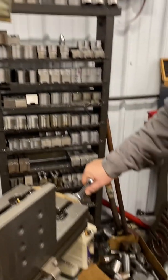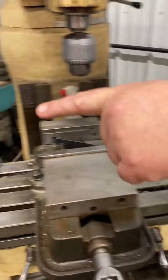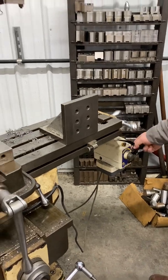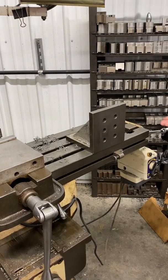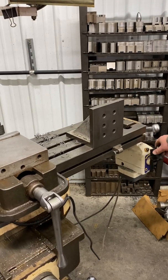This right here is my handle for my X. As you can see, the X table will move. I have a handle over there as well connected — you can go from either end. I also have one that has a motor on it; I can slow it down to feed it real slow if I have an end mill that wants to cut real slow. If I want to push this button and override it for rapid — good. And that is my X, back and forth.